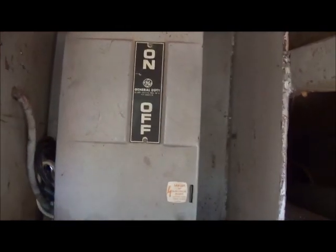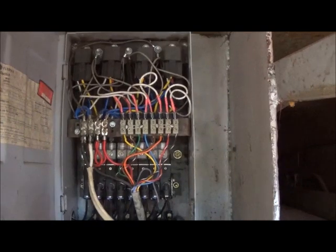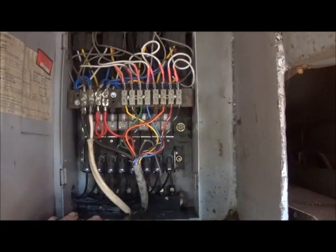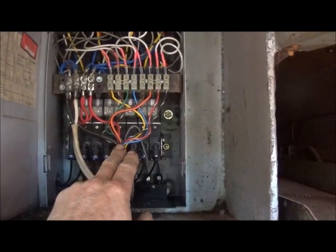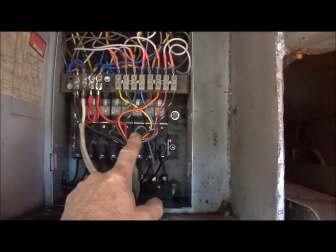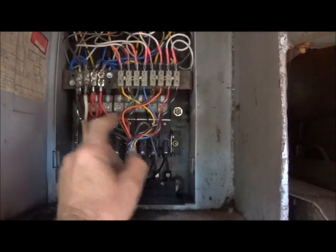Okay, we've got the doors open here and I've got a box — this is an old electrical box I used just because that's what I had. It'd be nice to use something waterproof depending on where it's mounted, but this isn't waterproof. However, it's inside the toolbox so I don't have any trouble with it. I'll open it up and show you. Now, this is like 10 pounds of stuff in a 5-pound bag — I wish I'd gone with a bigger box, but it is what it is and it all fit. These are the wires coming out and running into our control box. It gets power from the red wire and ground from the negative, and all the other small wires are functions — each function is a 12-volt impulse coming from that box.